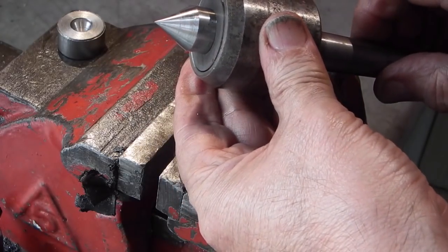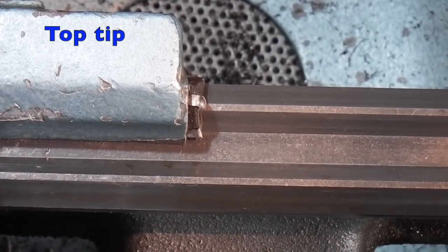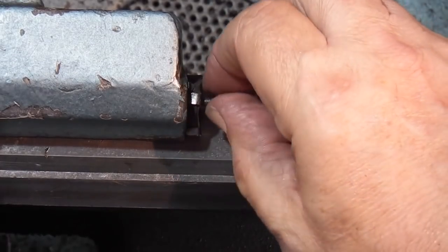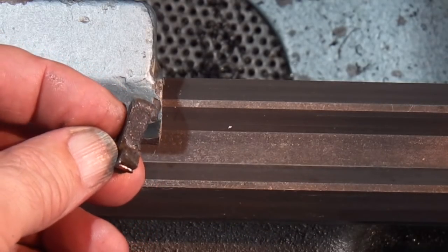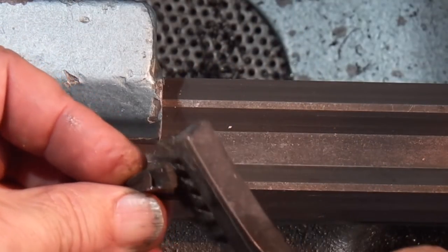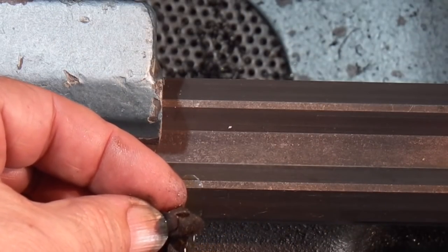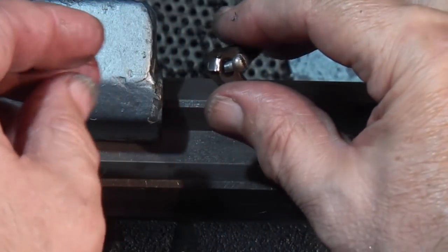So one refurbished revolving centre. I'm just cleaning down now - whenever you've done any grinding on the lathe it pays to clean everything to stop any grit. What I'm doing here is removing the clamping screw that holds the felt V-way wipers. You can see here you've got bits of swarf and dirt that's collected, so I'll use a small wire brush to just brush these out. Put some oil on and clean down the area - I use the oil to see where the felts are actually rubbing.